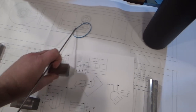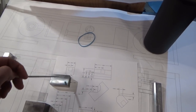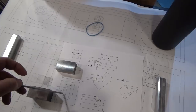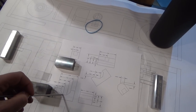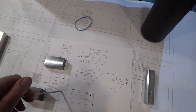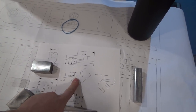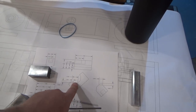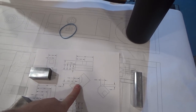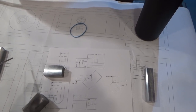Although I do need to bore a hole for the piston. It's a very small piston. It looks like it's 0.7 inches that I've got to drill in the top of this guy. The bottom part is going to be sort of more of the same. Mount it, mill out a flat to this depth on both sides, and then turn it 45 and go to a depth again. And that's why I have rotated the part, so that I know what this depth is. So I can touch off on the point here and then go down to the final depth. That's pretty much it. So I'm just going to set this up on the mill and I'll bring you back.